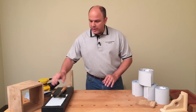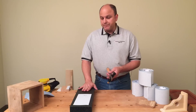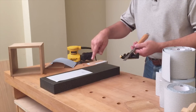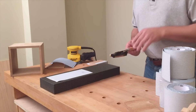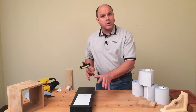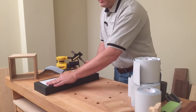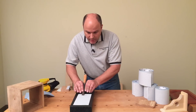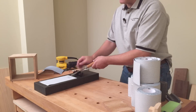Let's first start out over here on my granite block. A lot of you like to hone your own chisels, and you might have a granite block. If you don't have one, go down to your local kitchen install place — a lot of times they have the cutouts from the sink that will work just as well. I like this longer block; it's a 22-inch long surface. I can stretch the sandpaper all the way across that length if I'm trying to flatten out hand planes or do large projects. I've already cut a piece of this — you can see how easy it peels and sticks onto the stone, and it allows me to re-hone that edge and keep super razor-sharp edges on my chisel and plane irons.